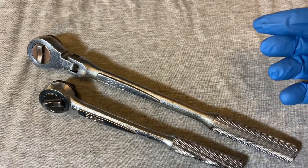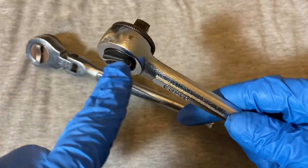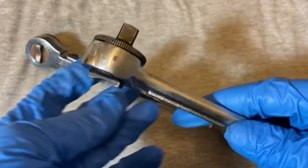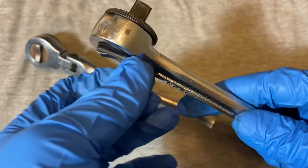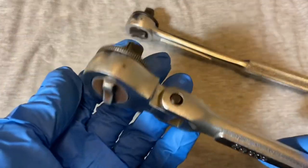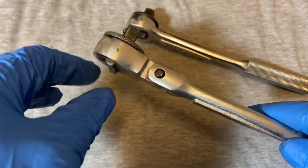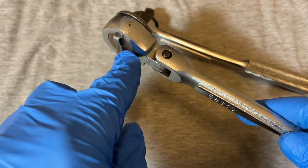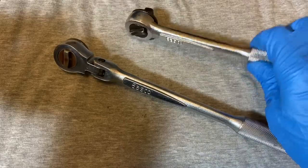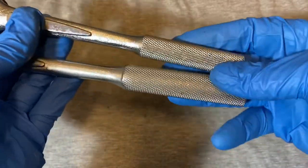Eventually they did get to use the quick release for this ratchet. One interesting thing about this non-quick-release ratchet is that you can hear it rattles when you shake it, because the switch is kind of loose. The same thing for this one — the switches are kind of loose in there. That has something to do with the quick release, because the quick release added tension to the switch, which kept them from rattling as much.